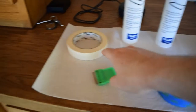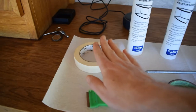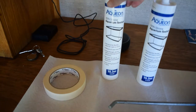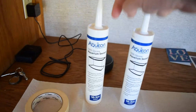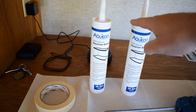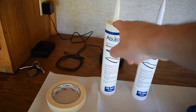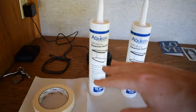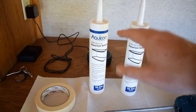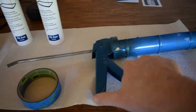So this is the stuff you're going to need. You're going to need a razor blade — I have a little holder for it just to make it easier to use. You're going to need some masking tape. Here I have some aquarium silicone, about $11.49 each. I'm going to put a link for these down in the description below — I got them on Amazon. I bought two of them because you don't want to run out and not have enough to finish your project, since you won't be able to adhere new silicone to old silicone. So make sure you have enough to complete the entire project. And this is a caulking gun — you put the silicone inside here and apply it with this.